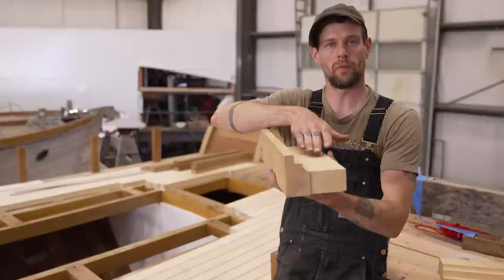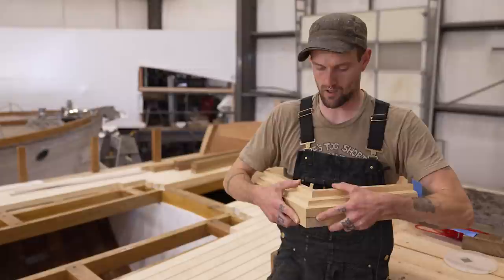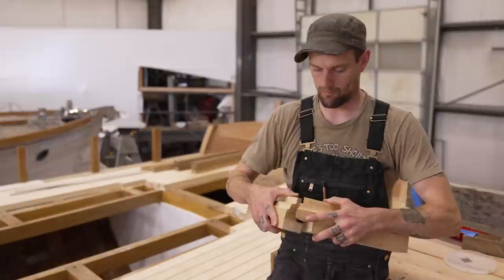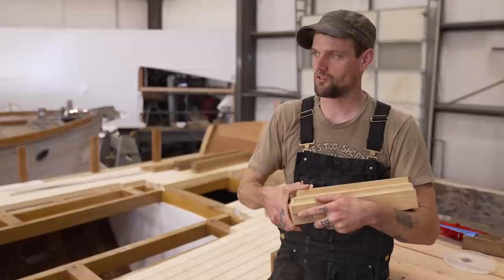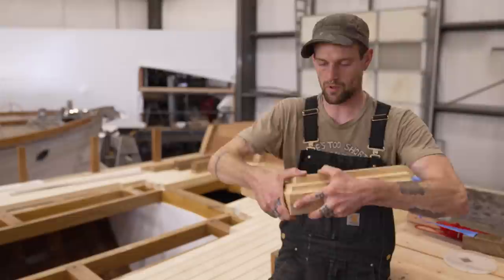A lot of these house sides, a couple of them are actually going to be removable. I mocked up this preliminary miter joint for our sills. They all have kind of a half lap miter here with the glue joint in our sill glue up. We wanted to hide this joint, so this is down below deck also. There's no exposed end grain, and then our coves meet pretty nicely. Hopefully we can do it at least this nice, maybe nicer, on our finished pieces.